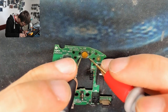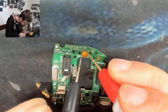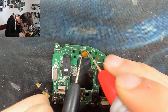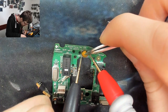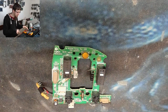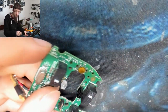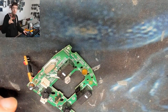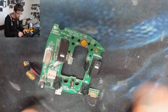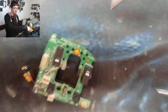I'll continuity test that. I'm not sure it was a good idea to try and replace that switch — but I think I've managed to get away with it. Tactile switches go diagonal when actuated — yeah. There's only one way to find out. I think it worked! It's got a nice big firm clunk, so when I middle click I should get a nice big 'kadoonk' on the mouse wheel.